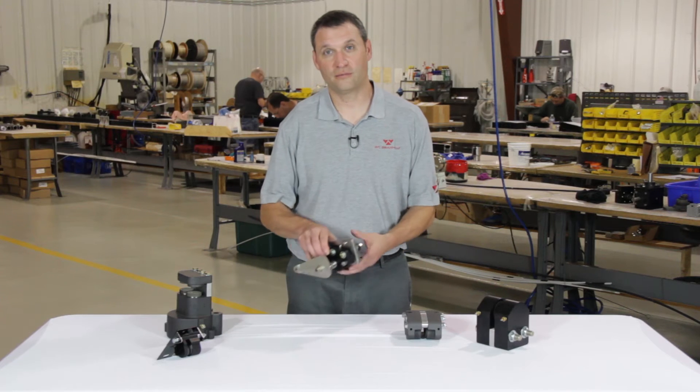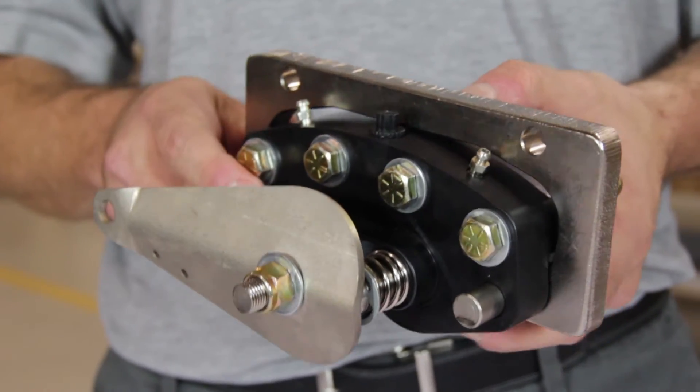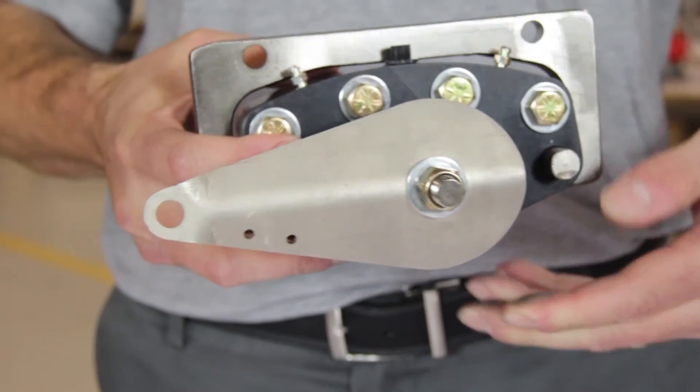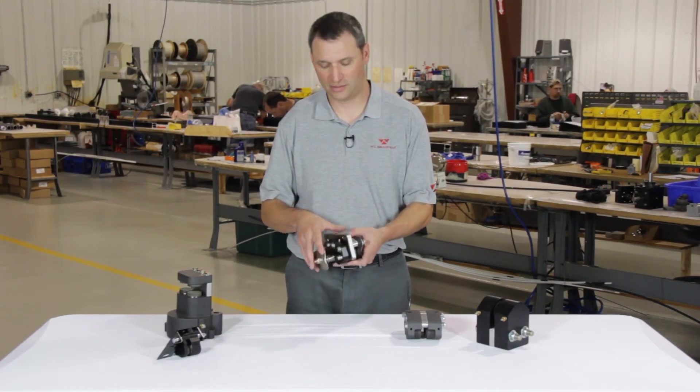In a single live-sided floating brake, the brakes are provided with a bracket with only one active side. You mount that bracket to your structure frame. The brake will then float to center and compensate for the axial movement of the pistons.